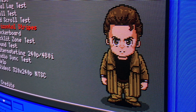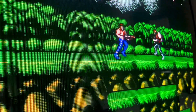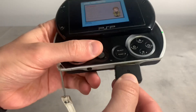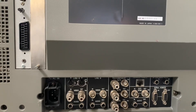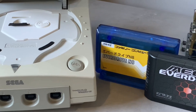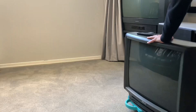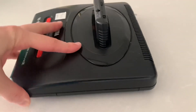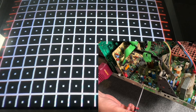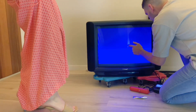Between the PS1's test suite and using the NES emulator to complement convergence and monoscope patterns, the PSP will be my portable pattern generator of choice when testing a CRT with component inputs. In the end, I recommend using whatever you have available that's convenient to run the 240p test suite when diagnosing, calibrating or buying a CRT. And just remember, take the test suite with you only to try out before buying, not for on-the-spot fixes. So leave your CRT toolkit at home, and try not to bother poor old Betty.